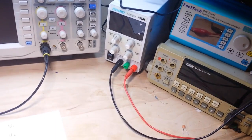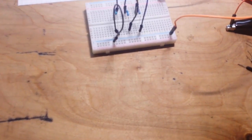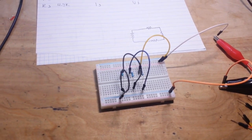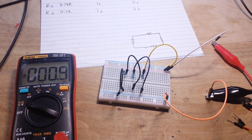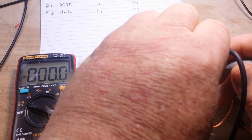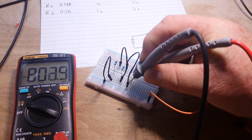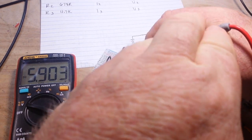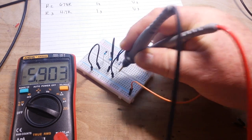We'll come up here and look at the power supply. Turn it on. We're back at our six volts. Let me zoom in back down here. Let's bring in the meter and take some measurements. I got the meter in here. We're set for voltage. And if we take a reading on the first resistor — if I can hold the probes in place with one hand so you guys can see what's going on — we get 5.9.